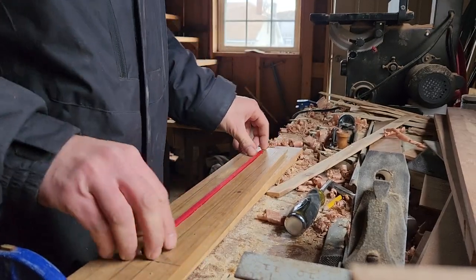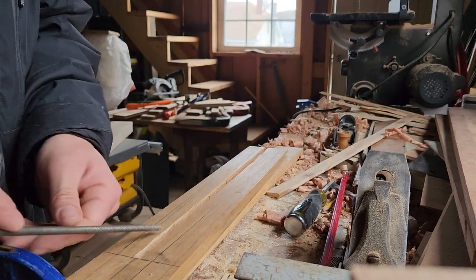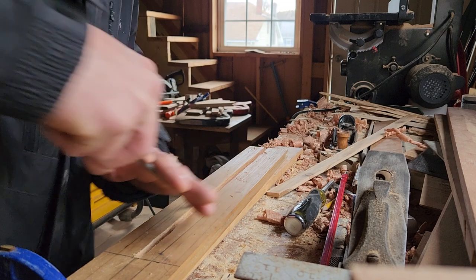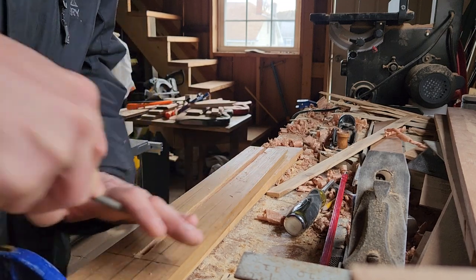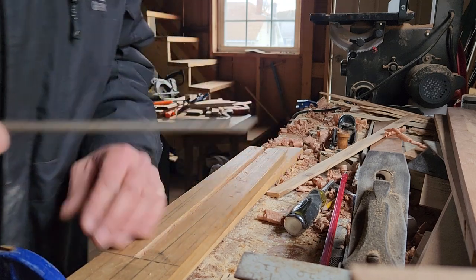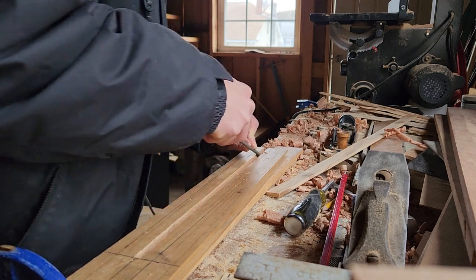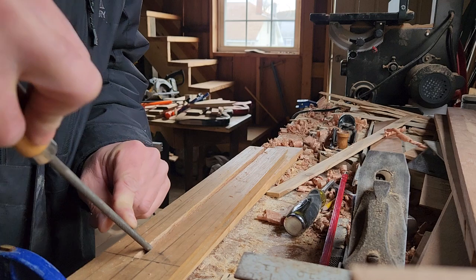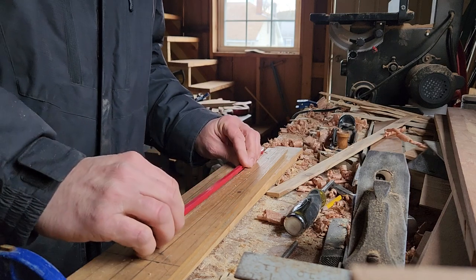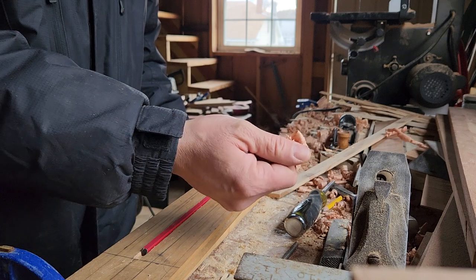Once I get these rough fit, take a round file, just run through, and that's going to round my bottom off here. I honestly don't measure enough when I do this stuff — you say measure twice, cut once. I eyeball it and cut shallow. As long as everything's straight and narrow, at least in my very limited experience, everything gets nice and snug. There's no wiggle room on either side.